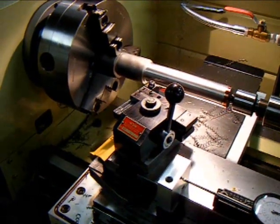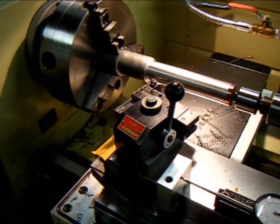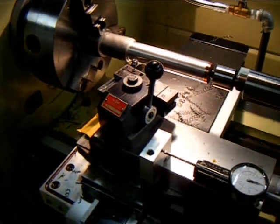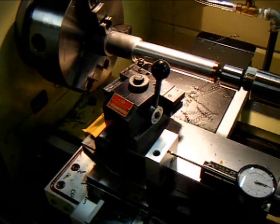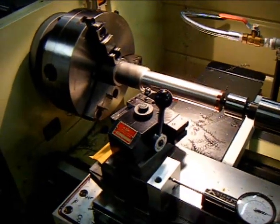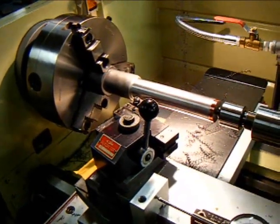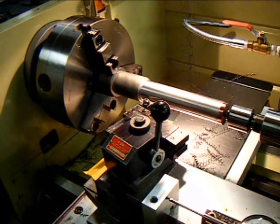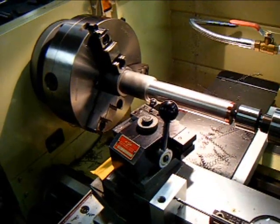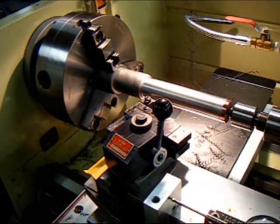You're pretty particular about your equipment, aren't you? I try to keep it clean — keep the ways clean. That's the main thing so the machine will repeat: keep the grit and grime out of it. I take apart the compound about once every couple weeks and clean it out. The jaws come out of the chuck every week. Some of the tool steel I'm cutting is in the mid to high 60s Rockwell — that's so abrasive you don't want that in the gears of your chuck. But with almost a year's worth of time on that three-jaw, I'm still getting within thousandths of being on center.